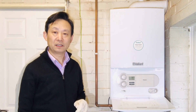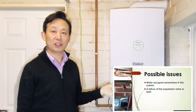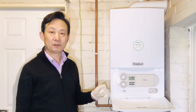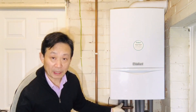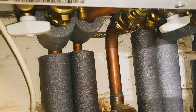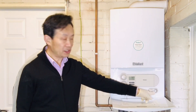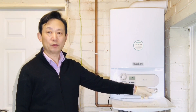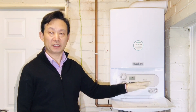What does that mean? You may have some problems. One problem is you may have water leaking in your central heating system, which means the water went somewhere. For that reason, what you can do is use the button below to top up the water into your system. After topping up the water, you will see the meter go up, which means you have normal water pressure. If it is maintained and working, you are fine.